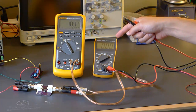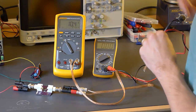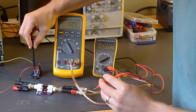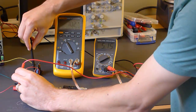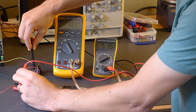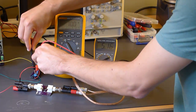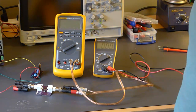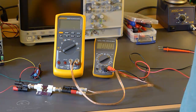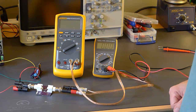Let's talk about the burden voltage of this instrument. We can see this multimeter here, and to measure the burden voltage, we want to know the voltage we're feeding this device. So let's put the probe on ground and touch the input voltage. That's 5.16 volts going in. Now let's measure the voltage coming out — 5.16 volts. So we don't have any burden voltage to speak of. The instrument works just as we'd like: no burden voltage, highly accurate current measurements in the low current range.